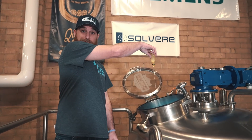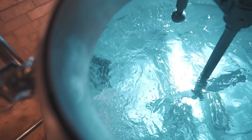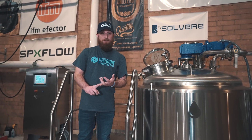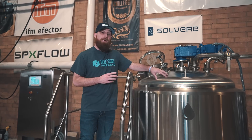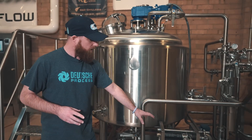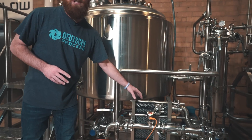Now after you've set your time, temperature, and mixing speed and everything is nice and stirred up, it's time to add your distillate. Once your distillate is added along with your sugar additives and syrup, everything's mixed up. The liquid in here, to get those sugars dissolved, is going to be pretty hot — anywhere from 160 to 180 degrees. It can go even higher if you're doing things like sweet tea and you want to super-saturate that mixture. To combat that heat, we're going to run the mixture and formulation through our dual heat exchanger.